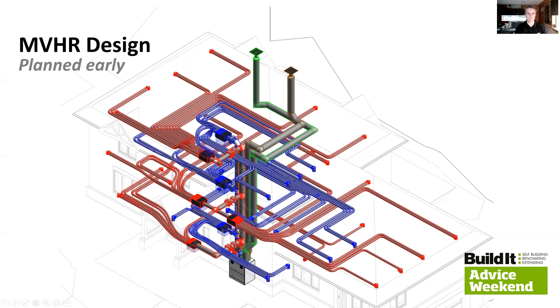At each floor we branch into that riser with a resettable fire damper, so there are no issues if it should accidentally go off. That runs into a heated cooler battery or coil — one on each floor — and that's going to connect to a reversible air source heat pump. So this property will get independent heating and cooling on each floor via the MVHR. On each floor there's a distribution manifold: one supplies, one extracts, and they are 300 millimetres deep. We were fortunate that we could hide all of that inside the floor build-up.